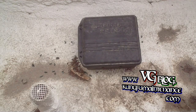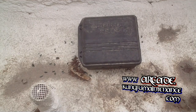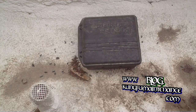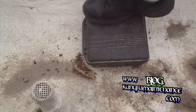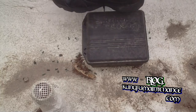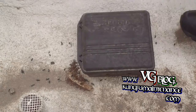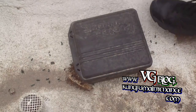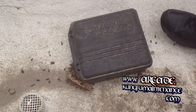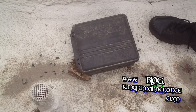You want to make sure there's no cobwebs and stuff at the entrance points. Also want to make sure it's placed in a good spot. Rodents — mice and rats — what they like to do is hug against the wall, against the corners. The reason being, if they're traveling in that corner, their predators are usually birds — hawks and such. They'll swoop down, snatch them up. So to only have one side where they might get attacked, they hug the corner. When placing bait stations, you'll want to put them up against that side.